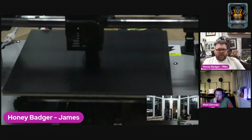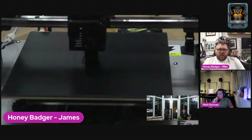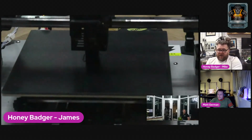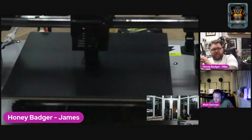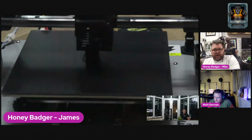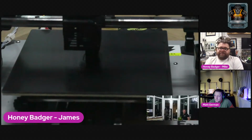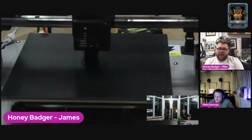Ender 3s can do it once you get them to that point. But Mike's got an Ender 3 that is converted to a Micro Swiss, and it's not 100% reliable. There are times where it clogs. There are times where it goes down. Parked next to it, I've got a Longer LK4 with a Micro Swiss on it as well. That I can just press print and immediately leave the room, and I know when I get back, it's all good. But I can't do it with the Ender.